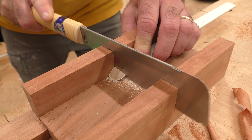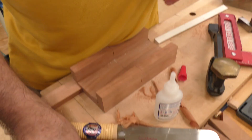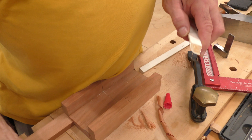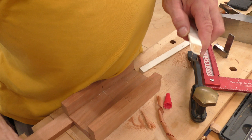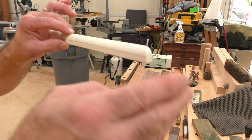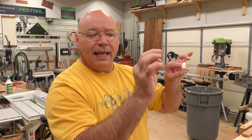The key to cutting returns on shoe mold is that you want the piece to sit flush up against your base molding. I spray a little activator on it, put a dab of CA glue on there, and you can prep these ahead of time if needed. Once it's on, it sits perfectly flush against the baseboard — great for when your casing is right there and the baseboard terminates into it. This is a really nice accent on your shoe mold instead of just grinding it off. Be positive and stay sharp.